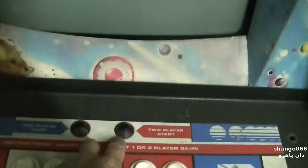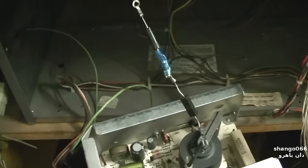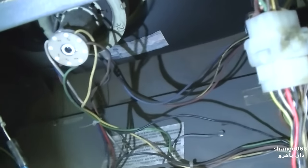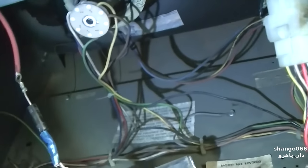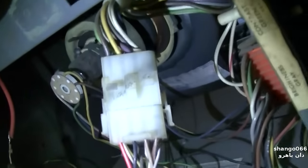You can smell it too. So why is the CRT not glowing? I checked the brown and black wires there and it was 1.2 to 2.5 ohms, and I checked it down here where the brown and black go into the connector right there and I'm getting 6.8 volts. So why is that thing not lighting up? What am I missing - do I have a bad socket or something?